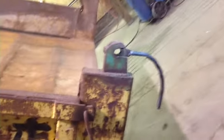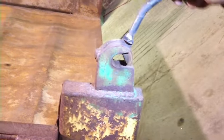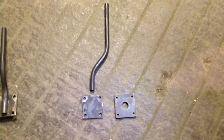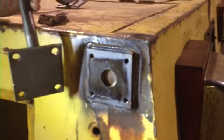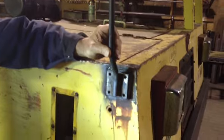The tailgate hinge latch has to be free and has to have this arm on it — they're quite often broken off. It has to be mobile so that you can latch the pin for the tailgate in there and lock it in, but still easily be able to take it on and off. Here are the three pieces that we use for the new mirror and mirror bracket. There's the mirror bracket once the rod is welded to the plate, and when it goes onto the machine, that's the other plate with the four holes — then the mirror bracket gets bolted to that plate afterwards, so you can remove it without cutting the mirror and it will fit in a container without making a mess of the paint job.